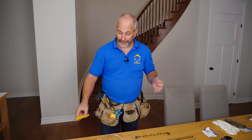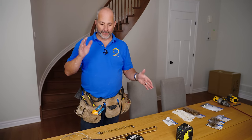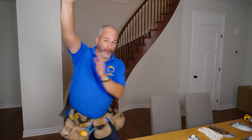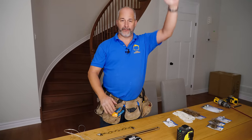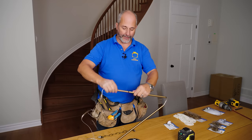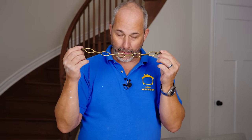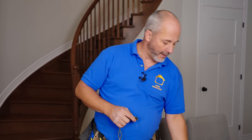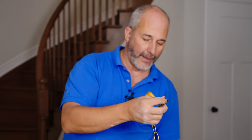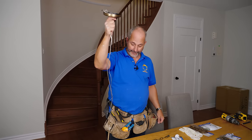The next type of light is another pendant, but it's acting as a chandelier. The concept is to get it centered over the table. The octagon box has nothing to do with the center of the room — it's way over to the side. This fixture comes with rods of multiple lengths. You want the fixture 36 to 40 inches above the table. We just have to take off this extra six inches, and then use the chain they supply. The chain is too short, but it has unique fittings where I can replace the end with a female thread to attach to the rod.